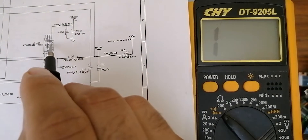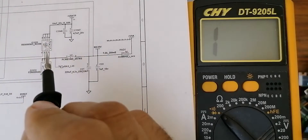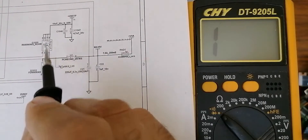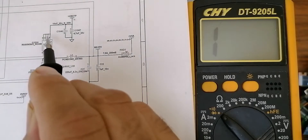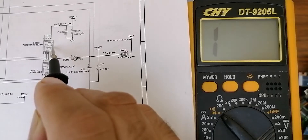Do you see the diode? The diode is between source and drain. That's why we will use the multimeter and check between drain and source — we should get a reading, exactly like we test a diode.